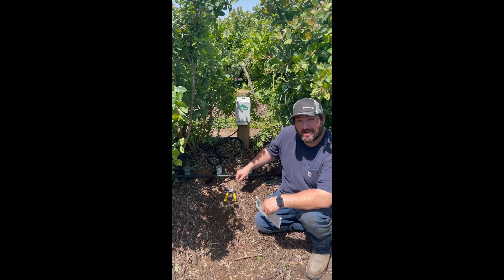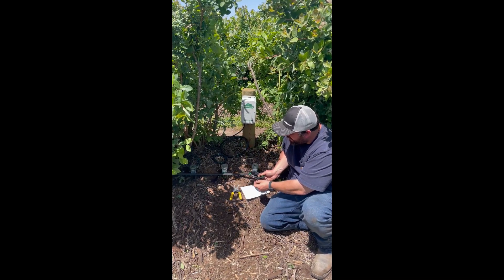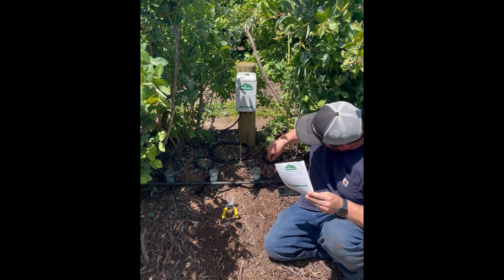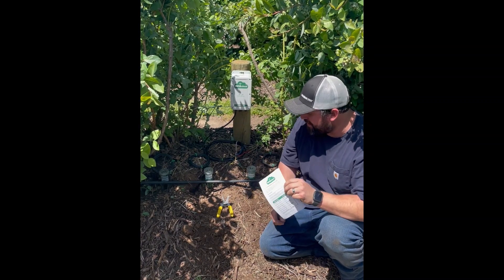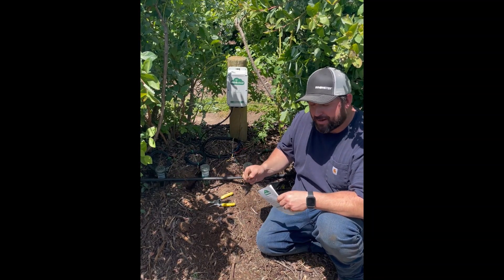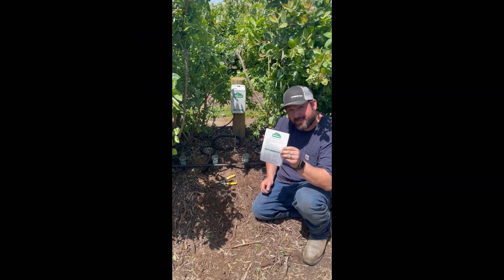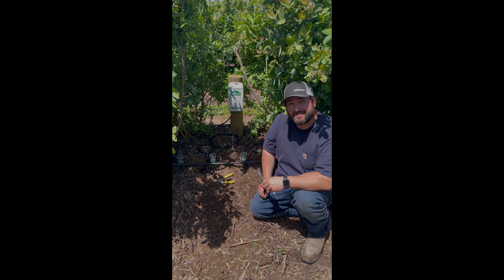Now that we have our tensiometers installed, the last step is to wire them to our unit. It's a very simple process — each tensiometer has its own set of three wires: a red, a black, and a white. If you look in your instruction manual that came with your unit, you'll see the wiring diagram. You'll utilize the wires from the IC10 and connect them to the wires on each individual tensiometer. Some will be common wires, some will be isolated. I recommend having snippers for stripping, and you'll need to use waterproof wire connectors — it's critical since it will be wet out here. With all the equipment, it should take about five minutes to hook everything up.